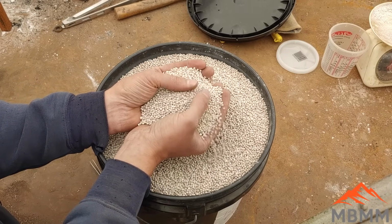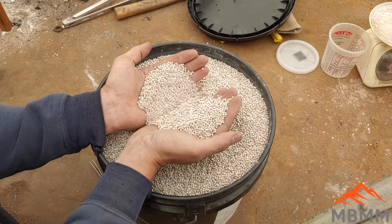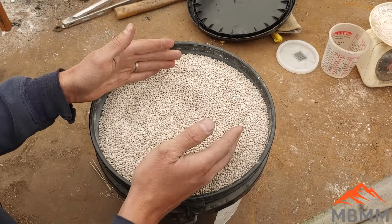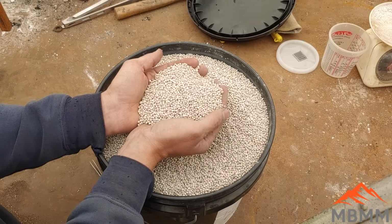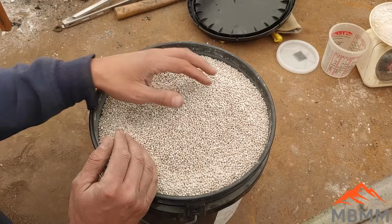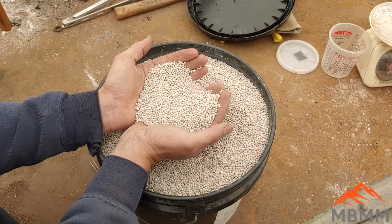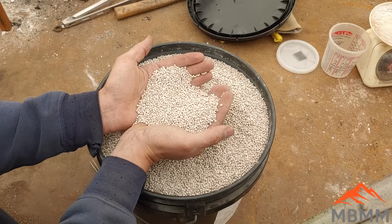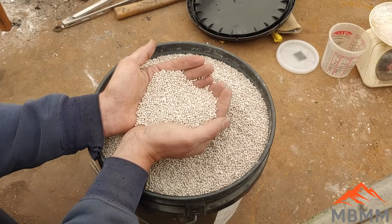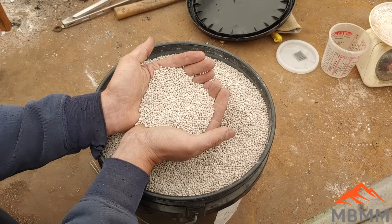So this is gonna be my next video, and that's what these two catalytic converters have been kind of leading up to, the two previous videos, is once I figure out the process, I can actually take the material here, these beads, and process them down and hopefully recover the platinum. So again, this is a little sneak peek for our next video. Hopefully we can start with this one here in the next couple weeks. And again, I'm gonna use silver as a collector and high sodium hydroxide flux and get the slag assayed, and hopefully we can get a really pretty high recovery of platinum off of these beads for this guy.